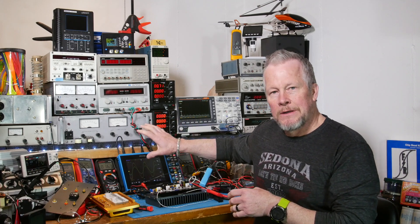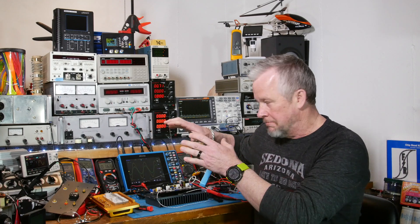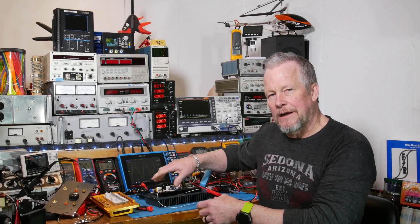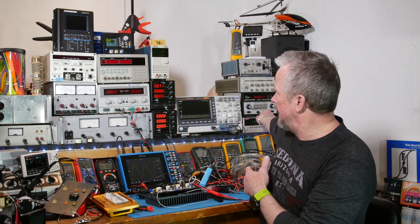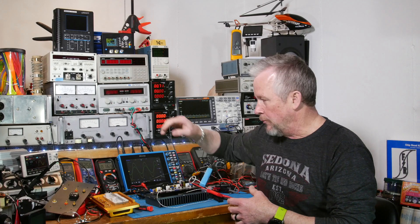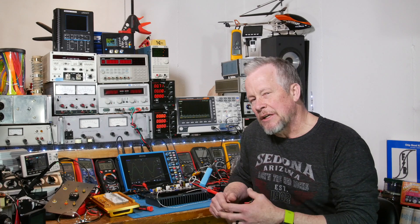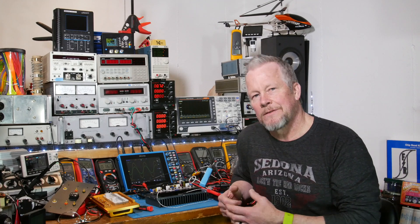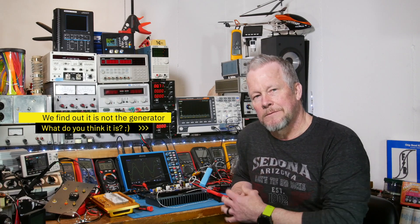I'm going to show you some signals I'm looking at — we're going to look at max power, show you that I'm getting 20 watts into 8 ohms, and show you what you'd get out of 4 ohms. I've got the THD meter back here, the Keithley, and also the GW. We're going to look at the spectrum mode, comparing the spectrum at the input from the signal generator and the output, because my generator is not super clean. So a lot of the THD that the Keithley is reporting is coming from the generator, and the spectrum on the scope should show that.